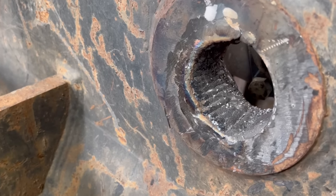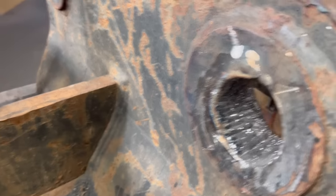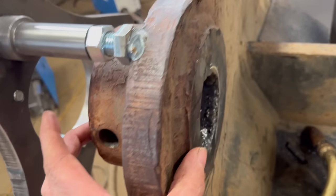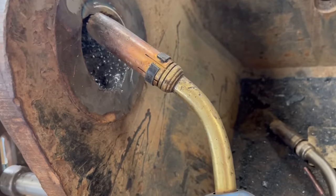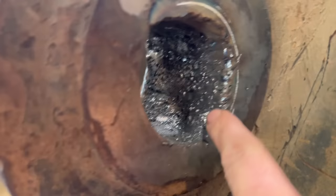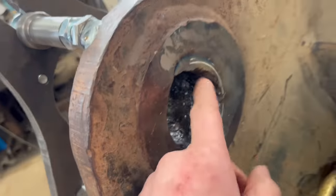Right, so I've got them all welded up now. That was not fun. I did not enjoy that at all. This one was tricky because it's an 80mm bar and it's 90mm wide. With this big torch, when I was welding through, and then when you get to the other side, because you're at not a very good angle, I think the stick out on the wire is too long and it was causing it to splatter a bit, and then all the splatter was falling back down onto what I've already welded. So it doesn't look brilliant, but